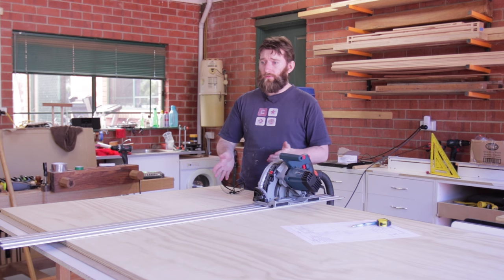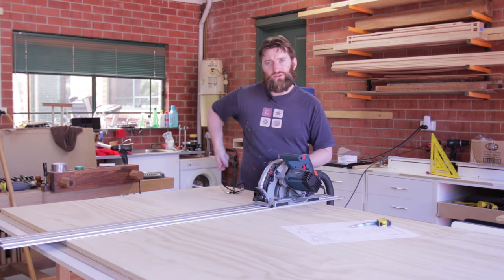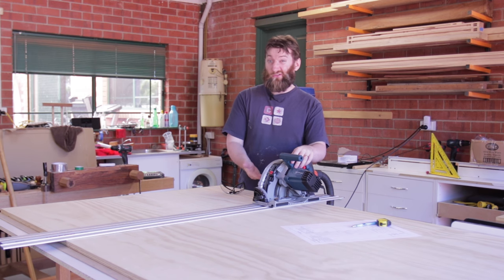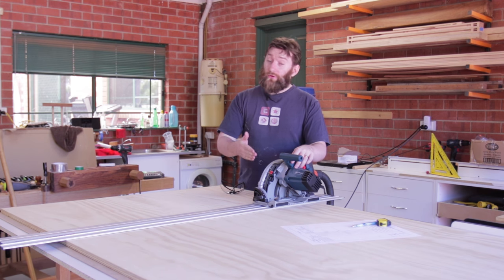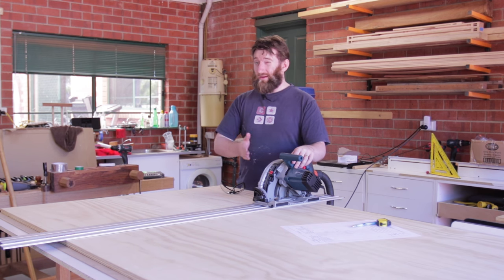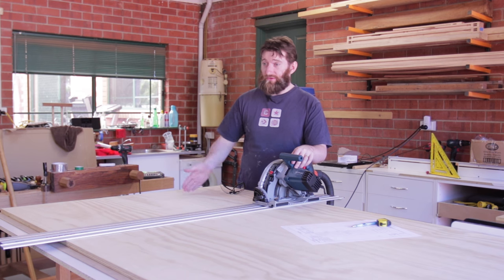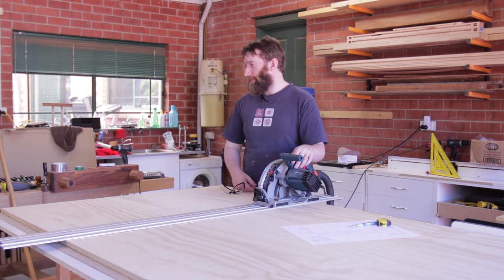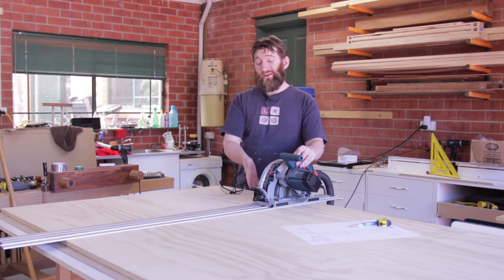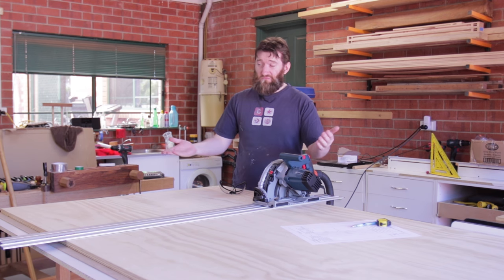This can all be done with a circular saw and a guide, whether it's a full guide or a side edge ripping guide. I'm going to use a track saw because I actually don't have a regular circular saw. It'll help me break down the sheet. I'll then rip stuff on the table saw and probably cut my angles on the miter saw, though the angles don't really matter that much so long as they're the same. Track saws are nice because they're accurate and have good dust collection — other than that, not much different from a circular saw.